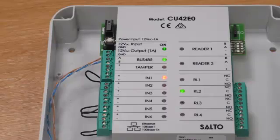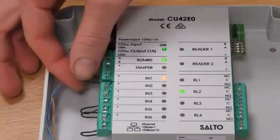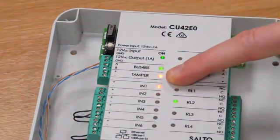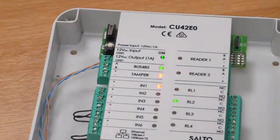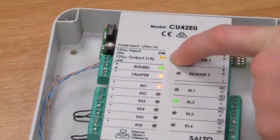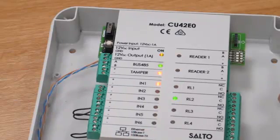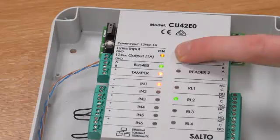Okay, so this is a bit of a close-up shot for you. So once you've removed the controller, this is the tamper loop. If you don't have the tamper loop, essentially you don't have to remove this because the tamper light will already be illuminated red — and that's due to this clip here which is deactivated when you remove the cover. Just press and hold this clear button for 5 seconds. Once you've done that, you'll see that the input light on the 12-volt section starts flashing amber. Remove the cable at the bottom — the RJ45 cable — and then insert your crossover cable there. This light will stop flashing once you send the details from the browser.